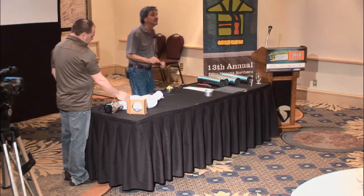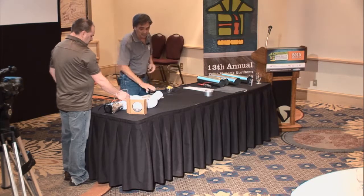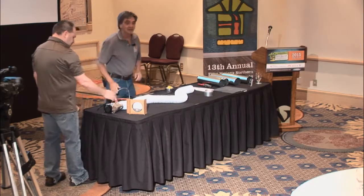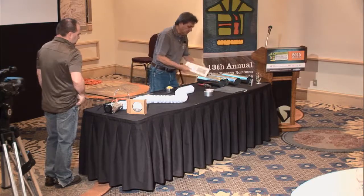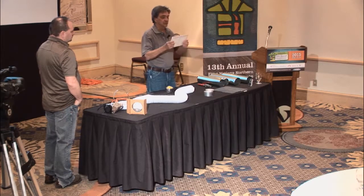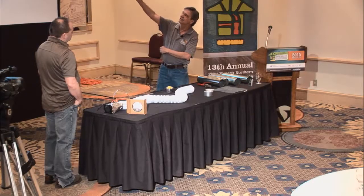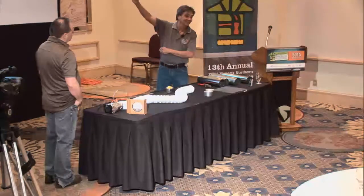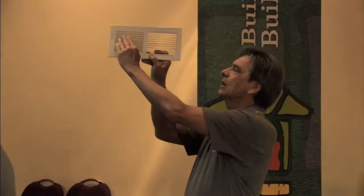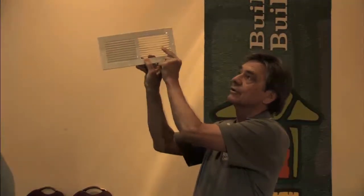And so if you start to find these in the stores, it's not going to happen for another year or so, but when you start to find them in the stores, you want to ask why they are doing that. It works better. Okay, so we're getting a little away from aesthetics and more into making it actually function. Now, in the next slide, we're going to take a look at duct sealing. And you may be aware that the Ontario Code actually requires that ventilation, or at least heating systems, be sealed totally in new construction, and we encourage going back.